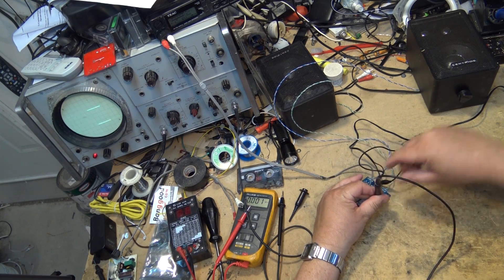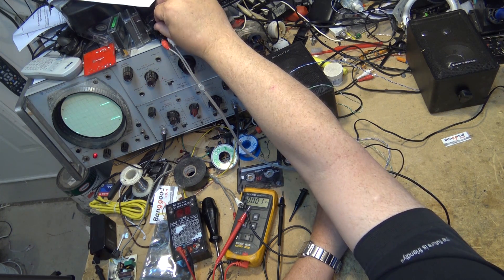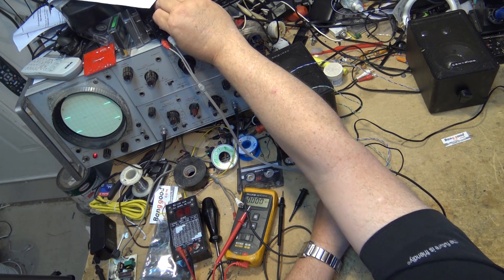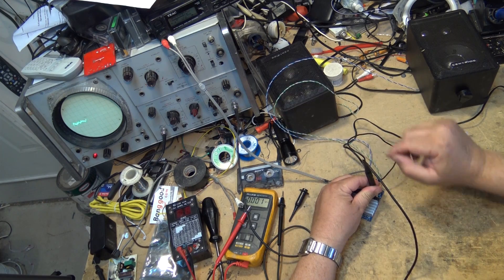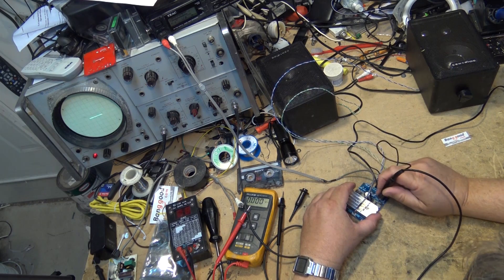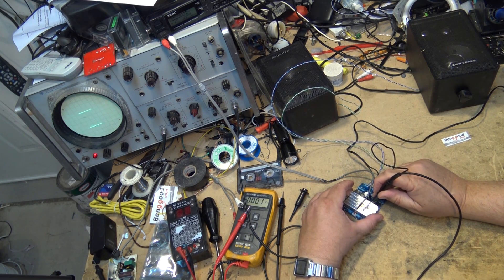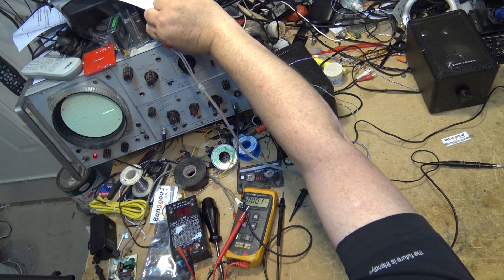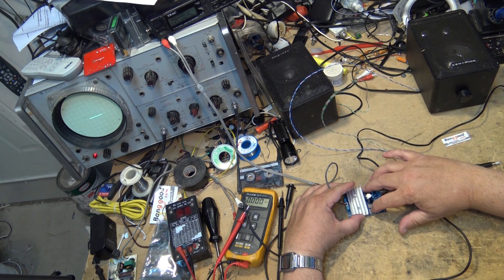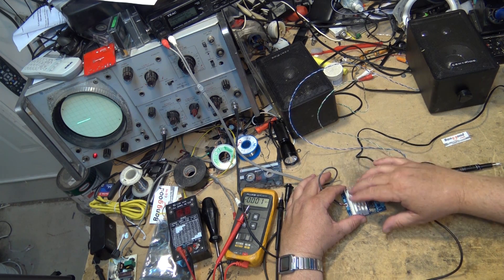You don't actually see the individual carrier waves. When I turn up the volume, you'll see a little bit there, but it still remains pretty much a square wave. So on the other side of the filter, we have two inductors — one for the positive terminal for the speaker and one for the negative. Basically there are two carriers placed out of phase. This is how you get such high power from such a small IC.